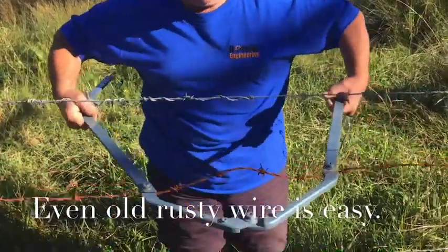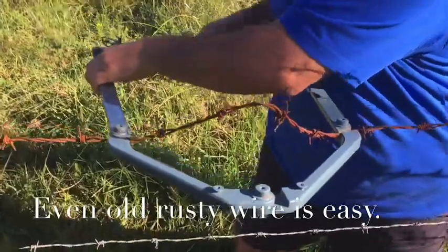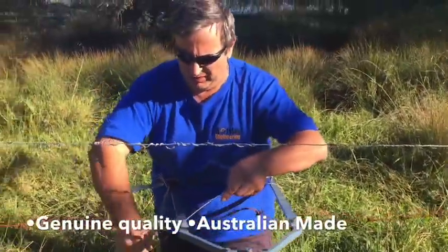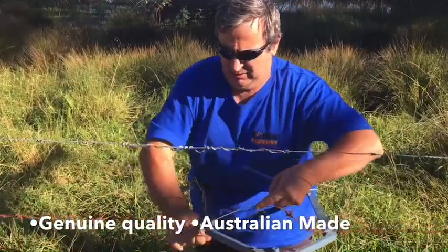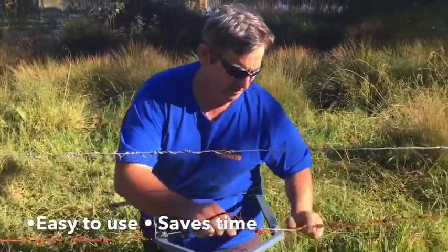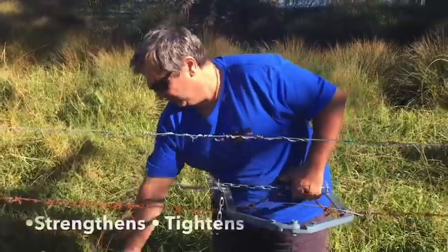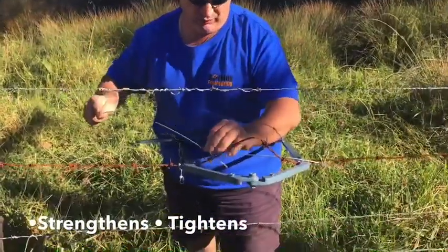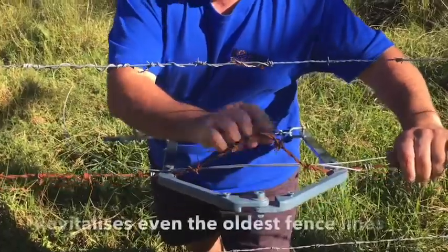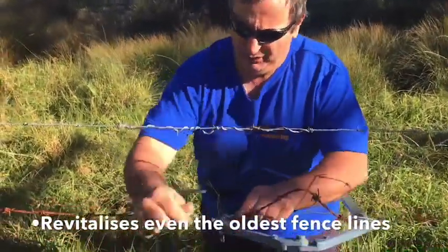That's one, two, and straight away you can see I've pulled that up. We don't want to put as much pressure on it. What I like to do on a real old wire like this is put a second pack of wire through — it makes the diameter where the wire wraps up a bit bigger. For this pack of wire I'm only using 2.5 medium tensile wire.